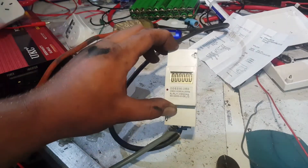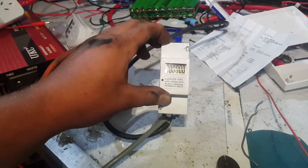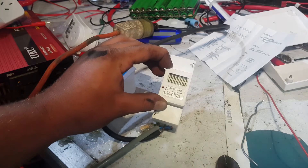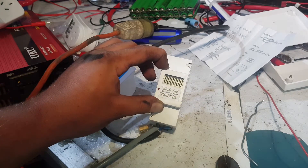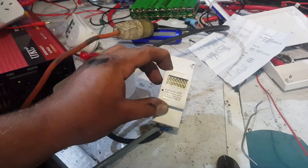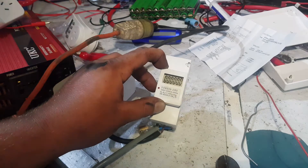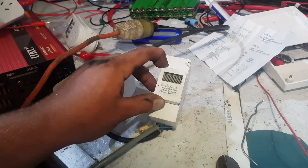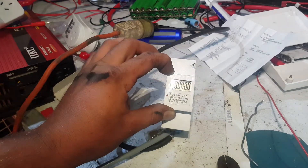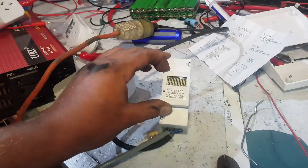The reason my camera started carrying on is because the camera is set up at 60fps. The head torch I'm wearing is controlled by PWM - pulse width modulation - and it sends cameras back when it gets in direct light. I'll give this a minute and see whether it has a memory or not. That's the big thing I want to know. It's going to go on the outlet of my inverter - it's quite easy to trip an inverter out. I think these are only 16 to 18 Australian dollars. Links in the top of the video description. If you buy one I'll get a little kickback - helps the channel out so I can keep testing these things so you don't have to buy them if they're junk. This will be installed in my panel on the outlet of my inverter shortly.